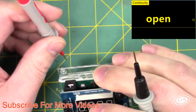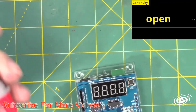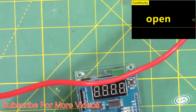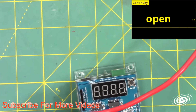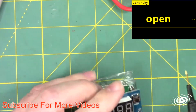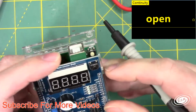Now, I wonder what happens if I pull this jumper out and I put this jumper over here. Does it change the continuity of these switches? It doesn't seem to. I would think you would have a switch on the A2 pin, on the digital pin 2, because that's your digital interrupt. So I would think you would have a switch connected to that.